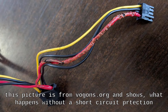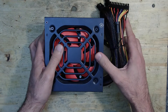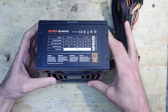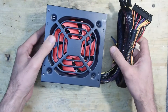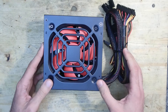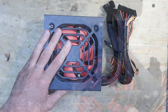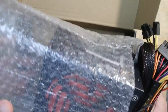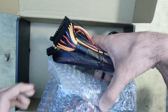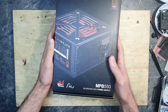The fact that it doesn't have any short circuit detection on the 5V rail is concerning, but you'd be surprised how many even expensive PSUs from well-known manufacturers also lack that protection — which in my opinion is irresponsible and should be forbidden. So would I suggest this PSU? I tend to say yes. It's less suitable for a retro PC but for a modern one it has great value, especially since paying two or three times as much doesn't guarantee 5V short circuit protection either. Please remember this was just a basic test — I just don't have the equipment for advanced testing. This review was not sponsored — just my honest opinion. Next time it will be all about retro hardware again. Thank you and goodbye.